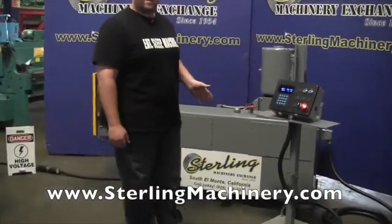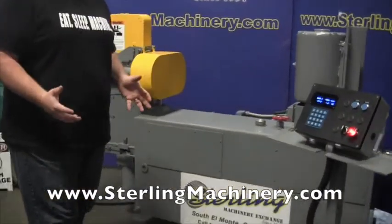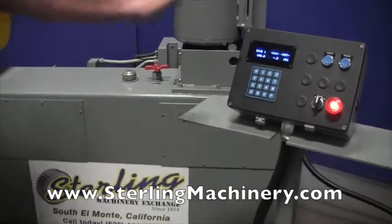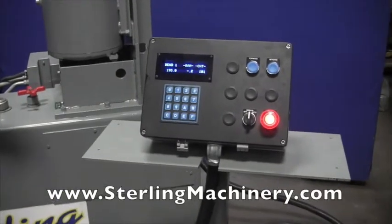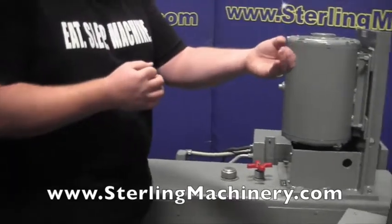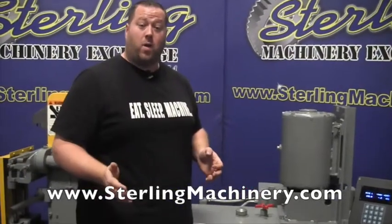Today we're going to show you a nice bending machine. A lot of you might be more familiar with a mandrel type or a job shop type. A mandrel type is going to be more for a thinner, longer walled material that you might have possible kinks if you were to bend different materials. So you'd have a mandrel put into it. So that's going to be for a lot longer stuff. We do carry those as well.